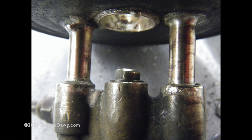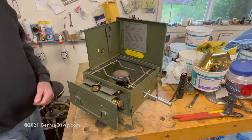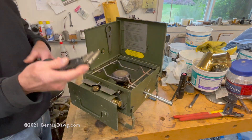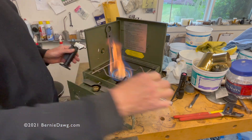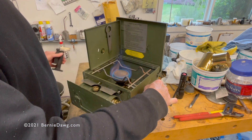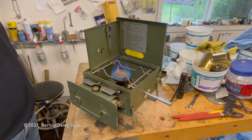But how did it burn? Well let's find out. Because of the very large burner head, these take a lot of preheating. So just when you think it's all preheated, you'll find that you need to throttle back and let the burner itself continue to heat up. That's why we're seeing some yellow here — it's not completely hot yet. Let's see how it looks after another 30 seconds of preheating.